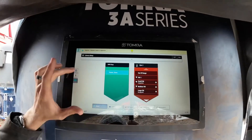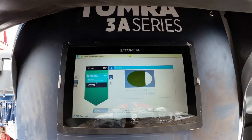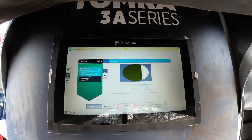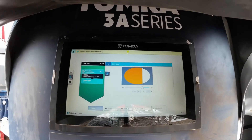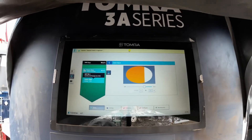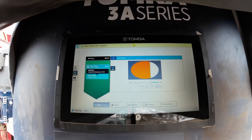You have clean potato — the green is what it's looking for as far as potato color, and you can make those adjustments. This is what the foreign material looks like, so you can make adjustments here as well. If the potatoes get wetter, dirtier, or cleaner, you can make these adjustments to teach the machine what you want it to look for.